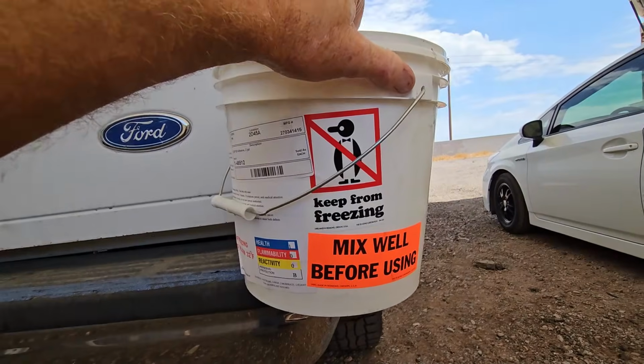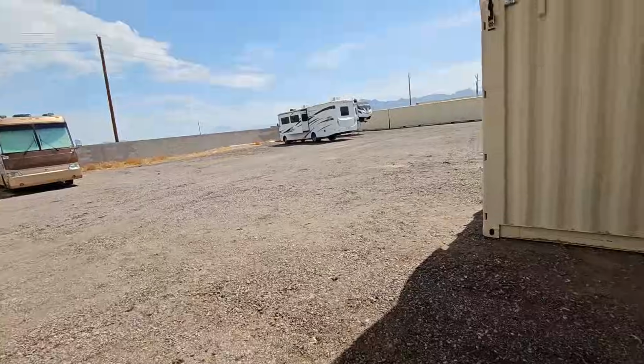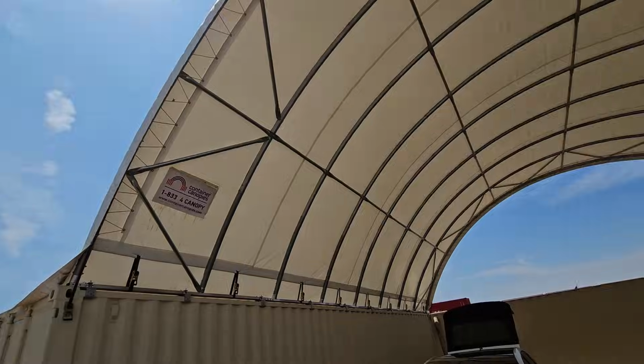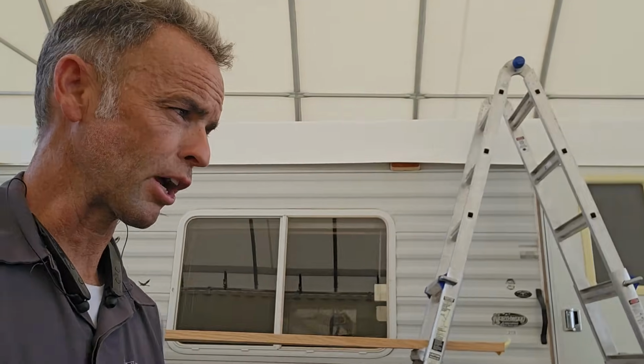But as the adhesive is water-based, it's going to be best not to do this in full sun. Even if it was wintertime, you do want to have some shade on top of the roof. Otherwise, the glue will dry too fast, and that causes membrane adhesive failure. And then, like most of these roofs, the easiest way to do it is from the side. With at least two people, have scaffolding set up so you can work from the side so you aren't working on the roof itself. Membrane's very slippery if you try to walk on it when the adhesive's still wet.